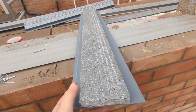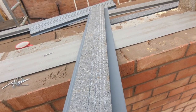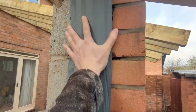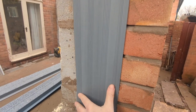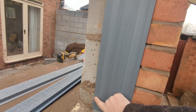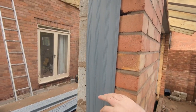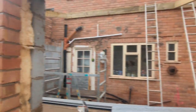It's just worth noting something I haven't explained yet - when you look at these things you've got a thin side and a thick side. Thick side goes inside - thick side to your internal blockwork. So that goes thick side to there. And then pin that with your nails. I go in the middle of every course of block - get it nice and tight. Any wave in it you've got to try and get out, because the window fitters just get annoyed and rip them out if you're not watching them. So yeah, nice and tight as you can. Then repeat the process on the other side.